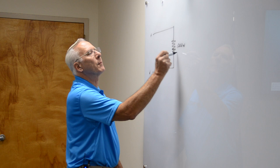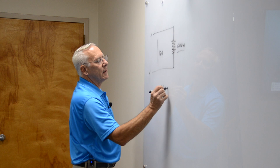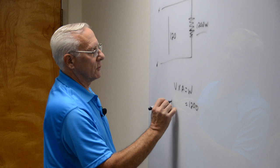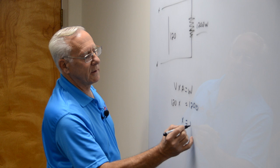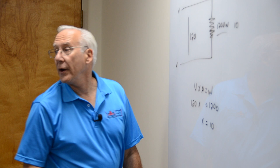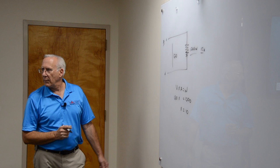Okay, let's do some math. We're going to tie it to an Edison circuit. This is 120 volts. Our formula is V times A equals W. 1200 watts is 120 times X. I know you did this in high school because I did. It's an algebraic equation. You divide both sides by the same number, you get X equals 10 amps. This coffee pot is now 10 amps. So this is usually a 20 amp circuit, so we're pretty good, right? One coffee pot, no problem. We'll make all the coffee, they can drink it, they'll be happy.